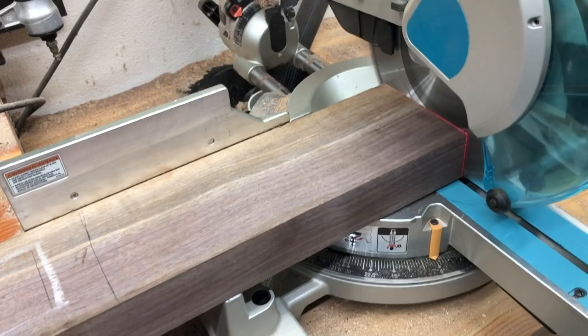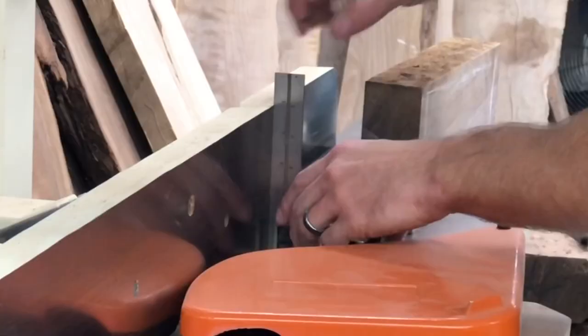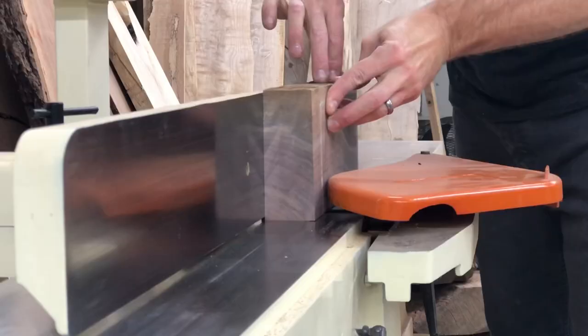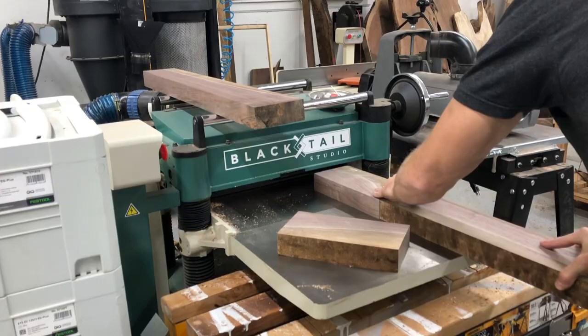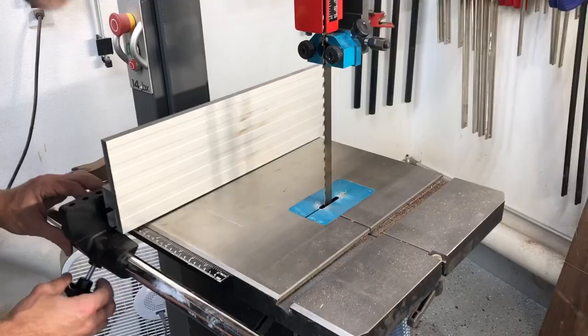What I'm doing so far is I made one mock set of legs out of just 2x4 stock, but it's going to be the exact size that my finished legs are going to be. I'm going to use each of those pieces as a template to transfer that over to these nice walnut pieces. Right now I'm just breaking it down to the individual sizes and individual pieces for that table base.